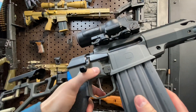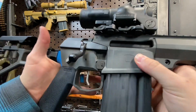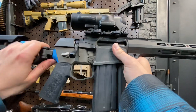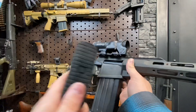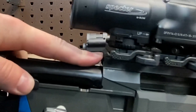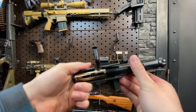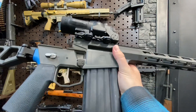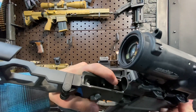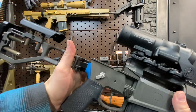Another really cool thing about the trigger is it's got a rotation on there so that it's perfectly balanced — that's for drop safety. If you drop the gun, it never wants to impart force for the trigger to naturally pull itself. The Radian panels have a fun feature where you can swap them out for various length levers or colors. Looking at the trigger inside the receiver, you can see the weighted mass in the front that balances it out, and the little bar that just comes up and touches the sear — that's really all you're doing, and that's why this thing can be so precise.